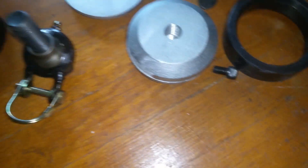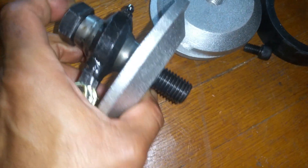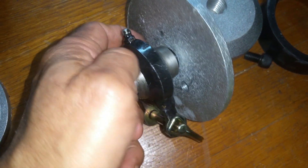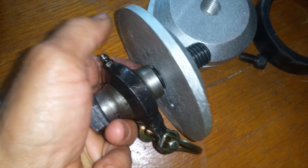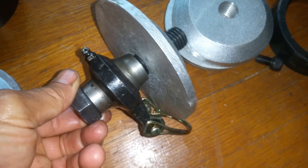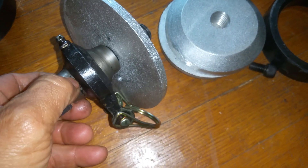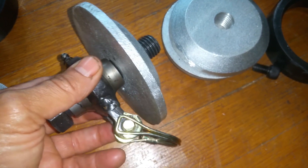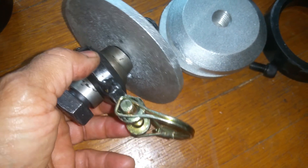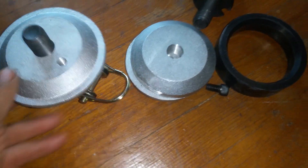So this is the spin screed. We are going to put it together and make this work. This bushing right here — it's friction. The whole thing is going to be rotating, spinning internally. Once you compress it, this will all rotate as one — this ring and this will rotate as one, around this bushing, and then we have another slip fitting. Ideally it will create less friction as this is rotating, and any snag between this material and the bolt would be relieved by this spinning, rotating bushing.